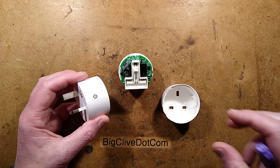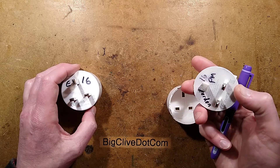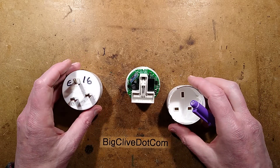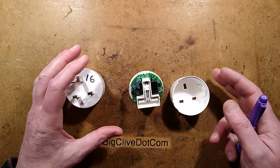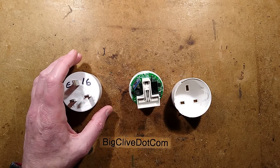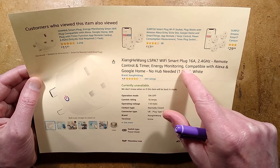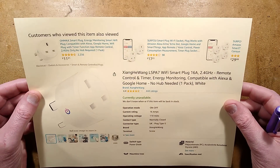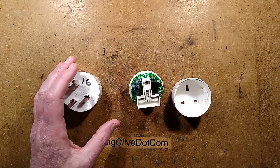Two Wi-Fi switches were sent for exploration by Gordon. He'd bought a load of these and after a while some started playing up and not working properly. He opened one of them and asked if he could send them to see if we could repair them. I looked these up and they are Ziyang Hewang LSP-A7 Wi-Fi smart plugs, 16 amps — that's a tiny relay for 16 amps. They seem to be very common and they've got more features than I was expecting.